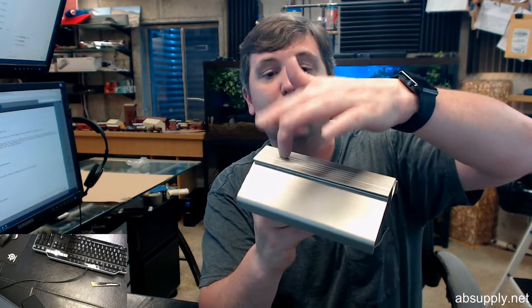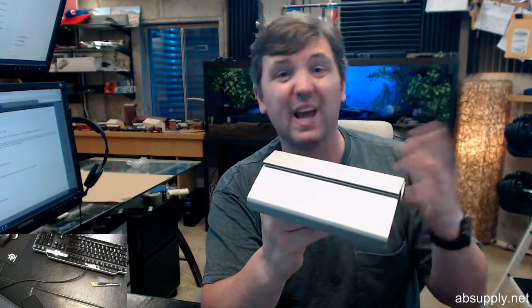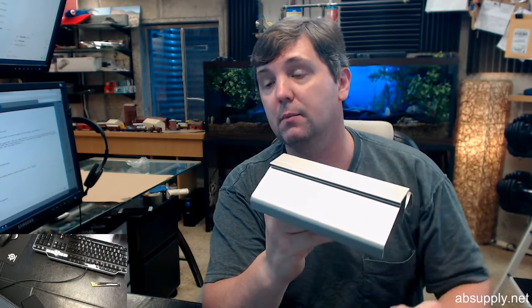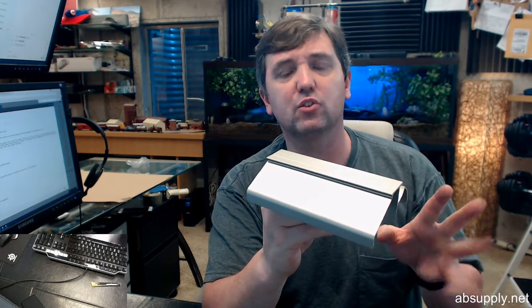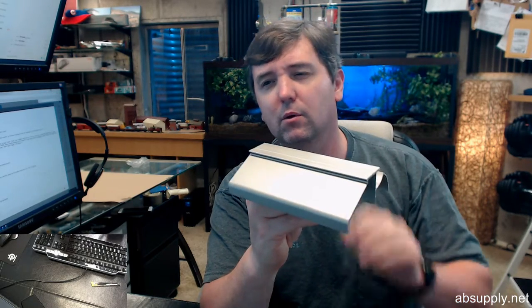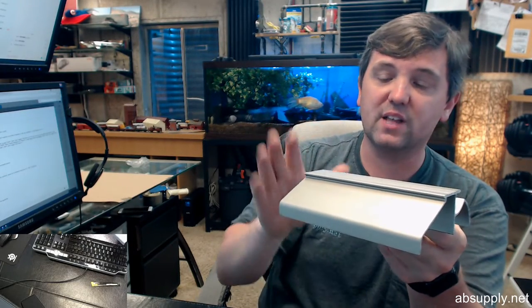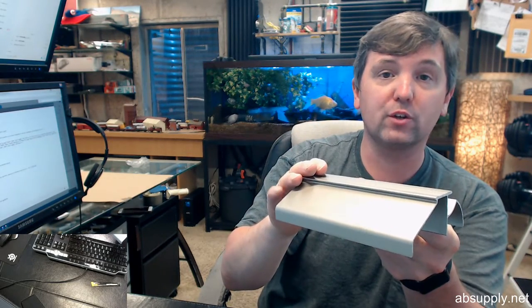If this was the genuine article, you're going to get a countersink at about 4 or 5 inches from the end, and then every 8 inches or so, maybe a little bit more, maybe about 10 or 12 inches perhaps. What I generally find is that if you've got a 3 foot threshold, it'll have 4 holes. If you've got a 7 foot threshold, it'll have 8 holes. That's generally what it is.